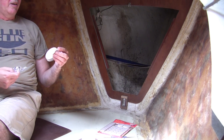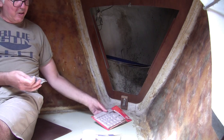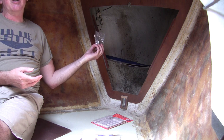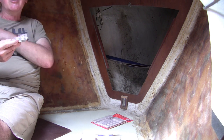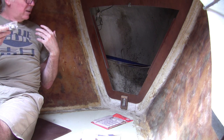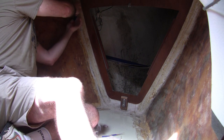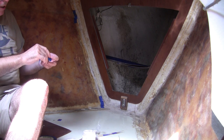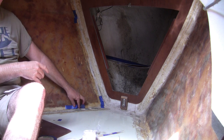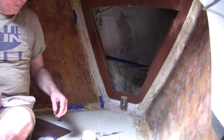Several viewers suggested this, and my daughter actually suggested it straight away - I've got some super strong magnets, these are 'Magnet Pro' warning small magnets. So I don't scratch the hull I've got some of those things you put underneath the feet of chairs. I'm going to stick these on there and then take these in strategic positions, check the magnets outside, and then I know that the line I'm drawing on the outside is exactly where things are going to go. Right, I'm going to place these in strategic positions on the inside, just along here a little bit so I can get the level of where the bulkhead for the bunk is.